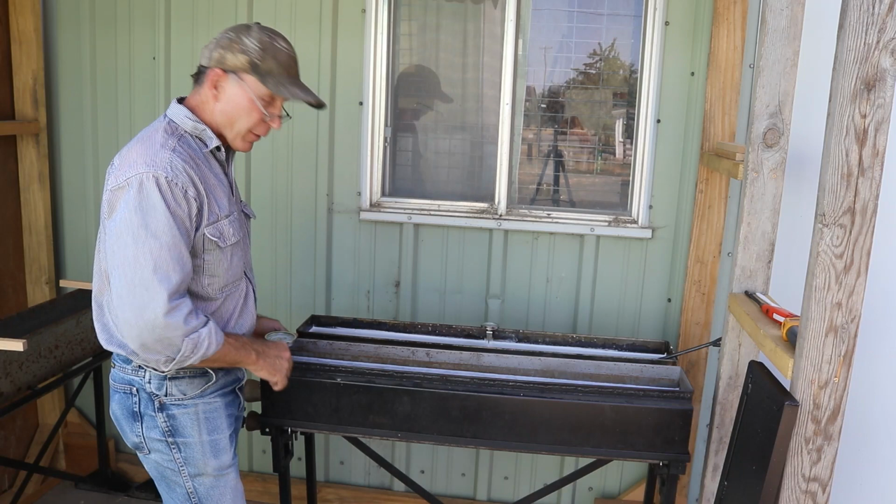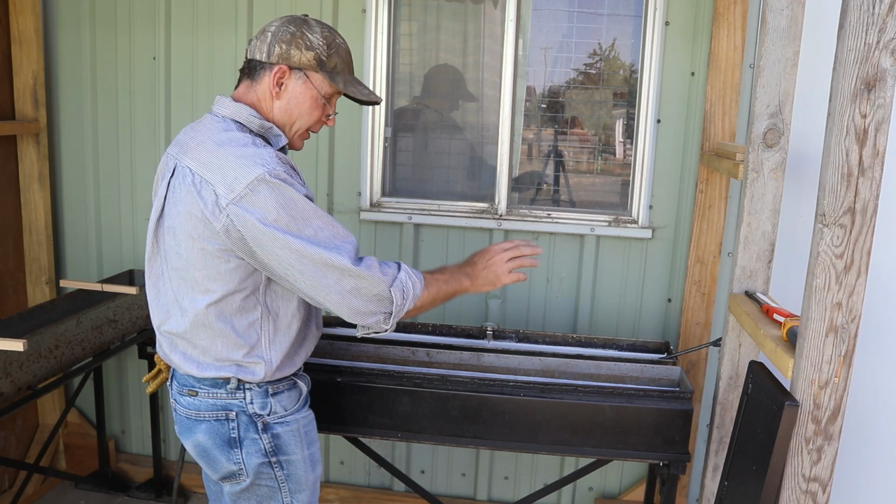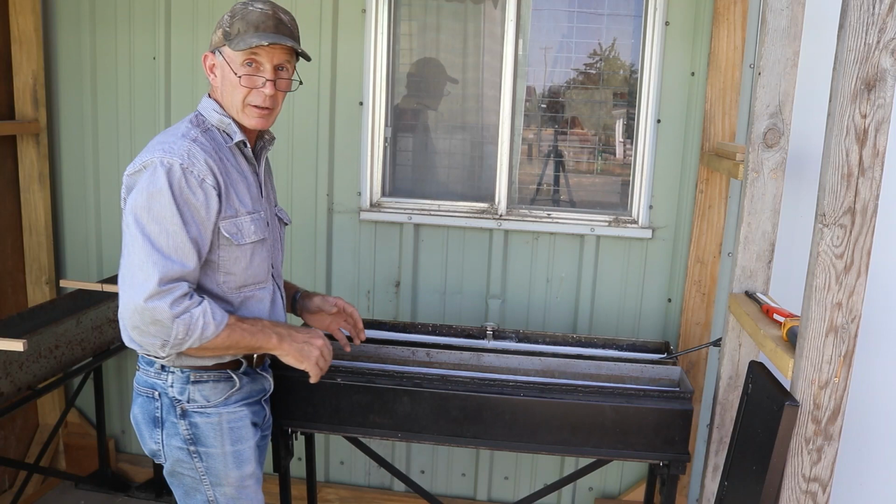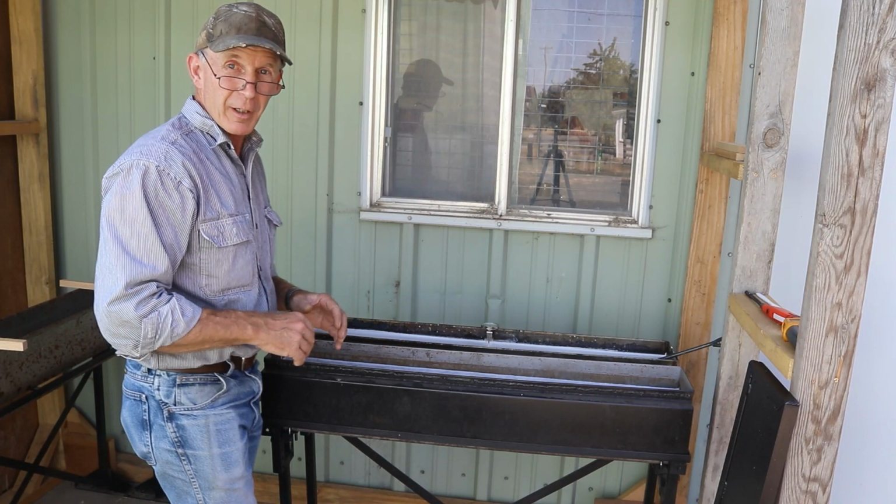got it out front because we're going to degrease the part first, then we're going to take it out, rinse the degreaser off, and then put it back in the bluing tank. And we don't want to drag our degreaser dripping into the bluing tank, because that degreaser will kill the bluing salts, and we want to maintain those bluing salts as best we can. So let's get these burners lit off and get both these tanks heating up.